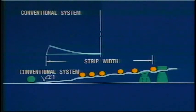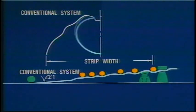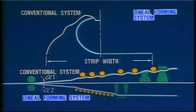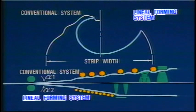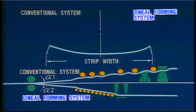Normal conventional roll forming systems are composed of 10 to 16 stands and the strip has to be bent on each stand. No wonder edge waving occurs easily, to say nothing of the space requirements for installation of overlong systems. In contrast, the forming zone of the new lineal forming system is reduced lengthwise to less than half that of conventional systems. Also, with the new system, the section between the breakdown stand and the fin pass stand is guided with many side rolls to ensure straight edge forming. High quality forming with no edge stretch is thus assured.